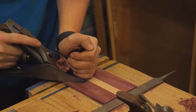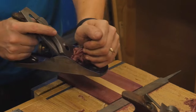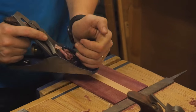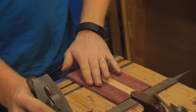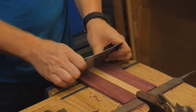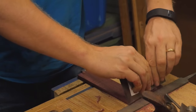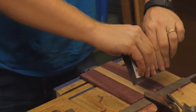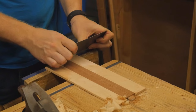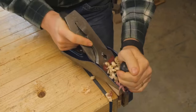If you ever want to increase your skill on making a flat board and not dipping off the far side, use a file to hold it in place. It will make you not want to dip your iron into that file. It's also there because my clamp is too small to hold it and I need something a little bit thicker but thinner than the piece I was using — and the file worked. Use a card scraper to bring everything glass smooth. I love working with a card scraper; it is an enjoyable tool. It gives you a really nice surface, and when you learn to use it, it treats you well.